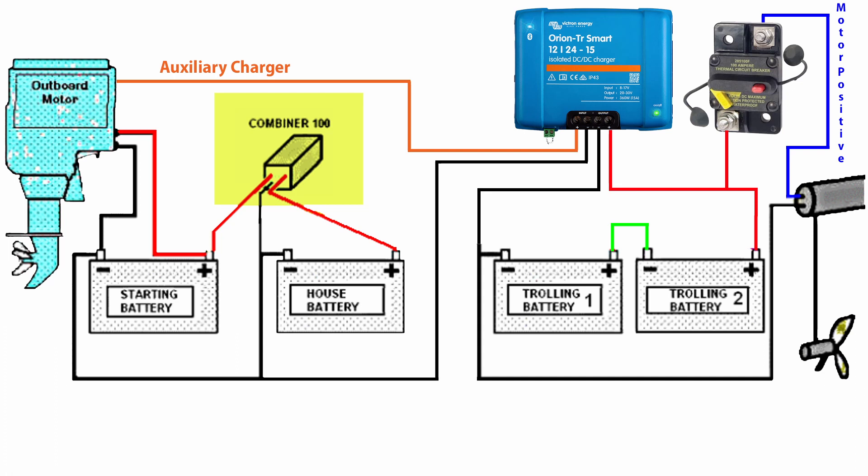And lastly, this one is the same setup but with the isolated ground — two 12 volt batteries connected in series to give 24 volts for the trolling motor, with an isolated ground to the Victron unit. Notice that in all of these setups, the Yandina combiner is common because that manages the charging of the house battery and the cranking battery.